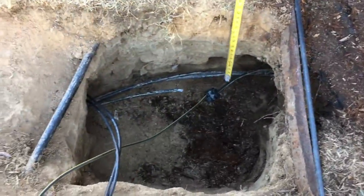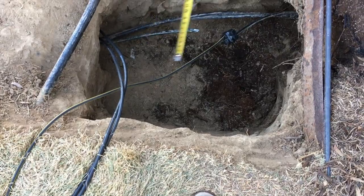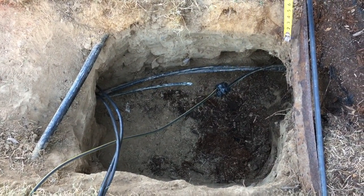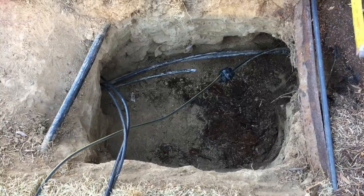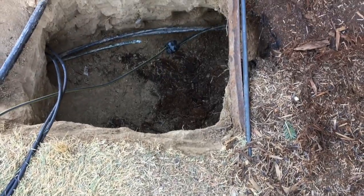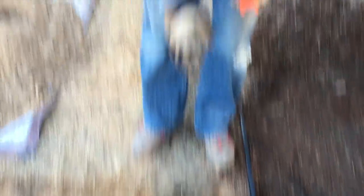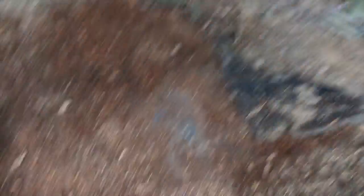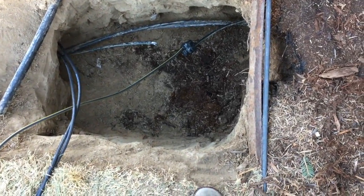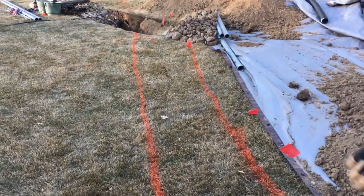I wish I had cut this one a little further this way — I didn't know this was bad — but I'll make it work. I may dig out this area right here, shove it down, push down the dirt to fill that, put the box right here, and gain a little more wire. What I'm going to end up doing is turning off power at the disconnect, cutting my feeders and hot conductors longer so they fold up better, then cutting out the grass and taking the mini X at 18 inches to scoop.